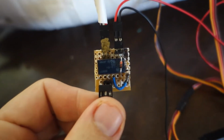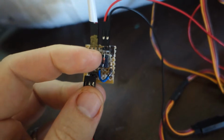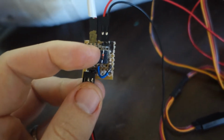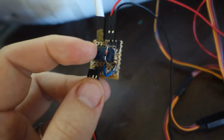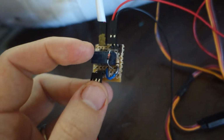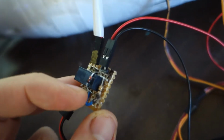And a quick shot of the board itself. It has one diode to prevent backflow, reverse flow onto the board. It's just a protection. When you de-energize magnets, they could send electricity back, and I don't want that, especially reverse. And here I have a pull-up resistor.